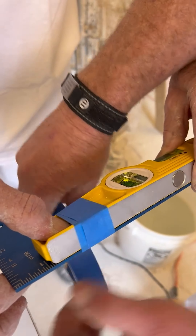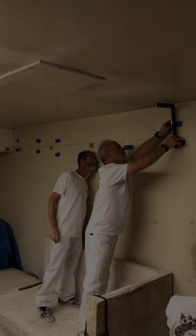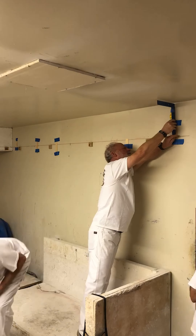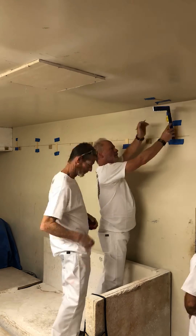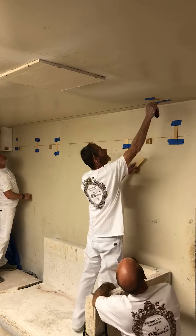In this step, we will use the framing square we modified. Place the bottom edge of the square on your drop line. Use the level to plumb the square and mark your projection. We will also repeat the dry-line process and use shims where needed.